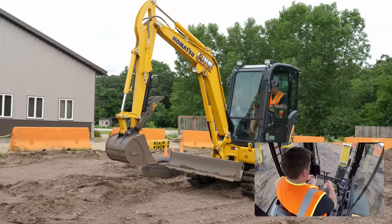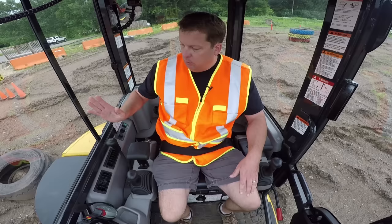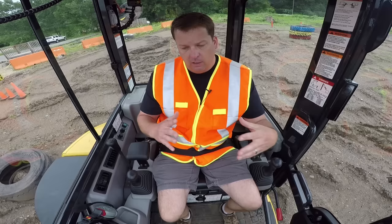Now let's say I want to dig right around here. I recommend taking your feet off the pedals so it doesn't cause any confusion. Before you dig, drop that stabilizer blade and put a little bit of downward pressure. Now I'm ready to dig. Like any other excavator, you generally want to dig ideally straight, lined up with your tracks. With that stabilizer bar, that's where the machine is most stable — you've got the largest footprint on the ground. You can dig at any configuration off the sides, but the machine just won't be quite as stable.